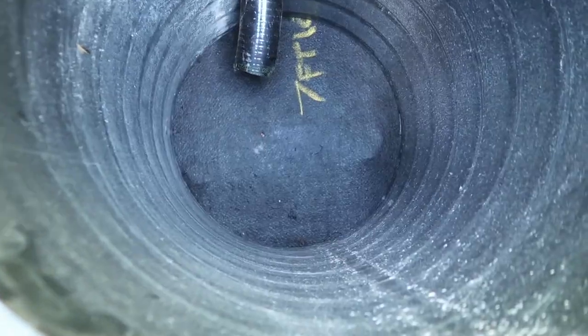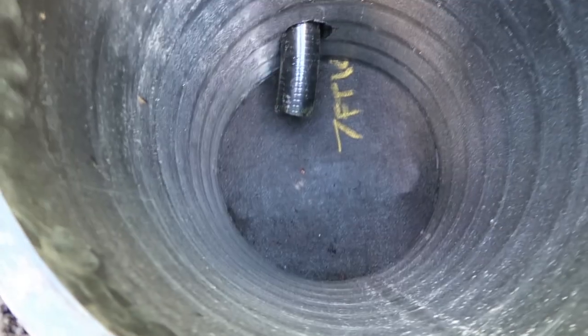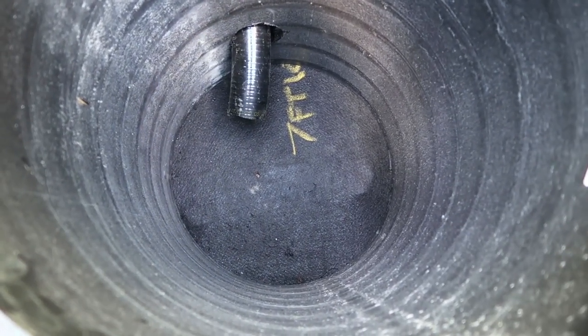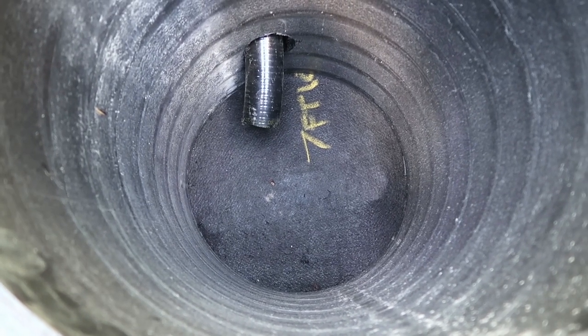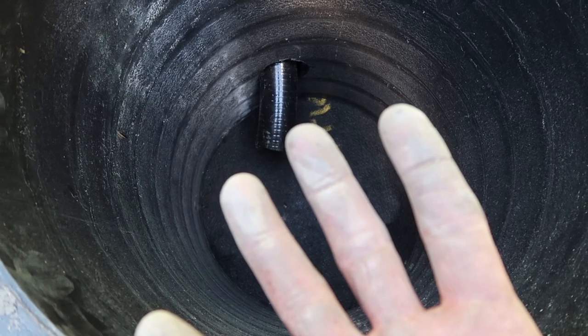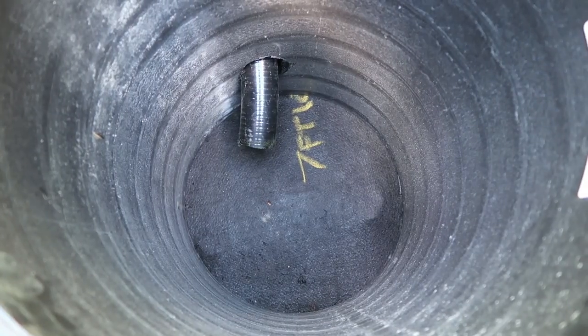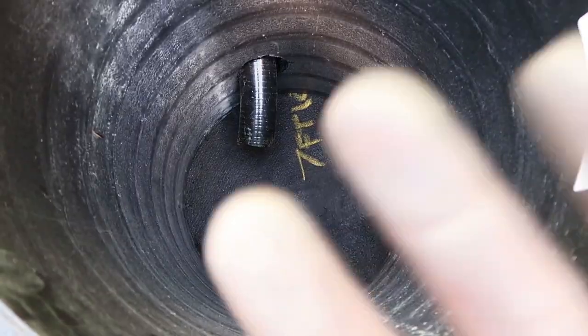At the bottom of this ADS pipe, I ended up taking a piece of our geotextile underlayment and basically made a bonnet at the bottom, then used very heavy duty zip ties and zip tied it to the bottom. The reason I did that is I wanted a permeable layer so that groundwater, in the event that there is some, can perk up through that fabric and fill the sump pit without bringing any debris inside with it.